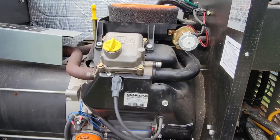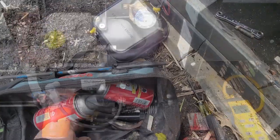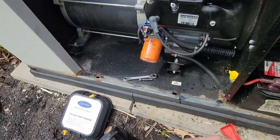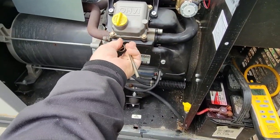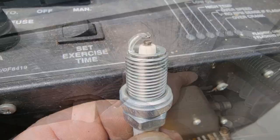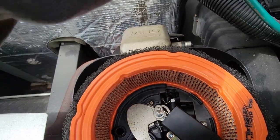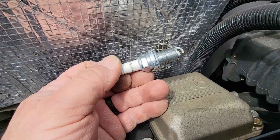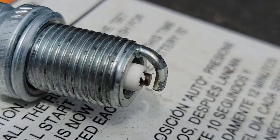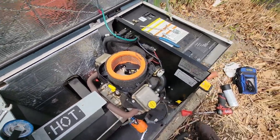Should be firing - we've got spark, got rotation. Are our spark plugs bad? Let's take a look at them. Maybe we have bad compression - that could be a possibility too. My favorite spark plug tool for these things is this old-fashioned generic piece of work that used to come with the kits - it just gets into tight spots and you can get it right out of there. Looks like it's been burning, doesn't look too horribly bad. I want to make sure that we are on the natural gas setting - and we are. Looks like a little something goofy on the end - looks like creosote of some sort.